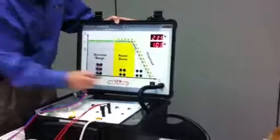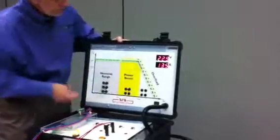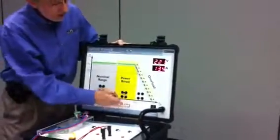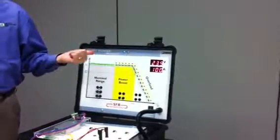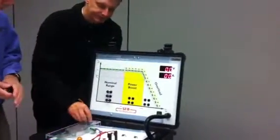It's not a problem. Well, I mean, here's 10 amps. At 10 amps, it's reading 23.9. Okay. And then when I load it into boost mode, it starts to drop some. Now, the point I want to make though is, I don't know how long this will hold up. Ours will do this forever in extended boost mode. It'll still operate at 24 volts at 40 degrees C forever. Just so you get the comparison.